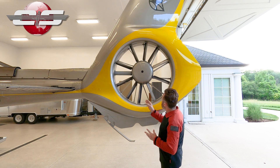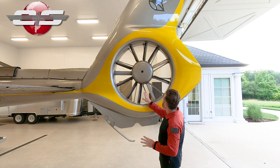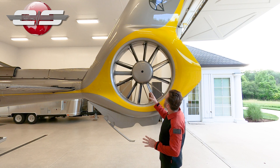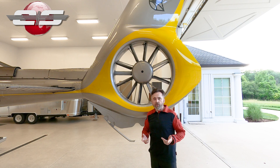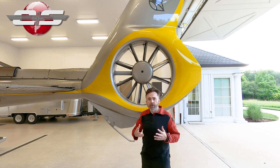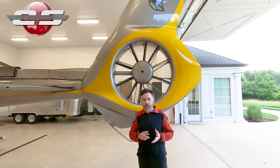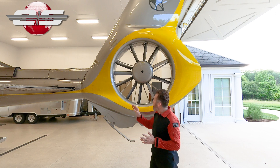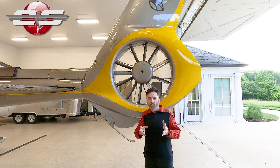So when the pitch is changed via the tail rotor pedals, you'll see that all the blades move simultaneously, and you can see that they're staggered for noise reduction. If you have ever heard an old Dolphin, all the blades were equally spaced, whereas now on the new fenestrons they're unequally spaced to get rid of that noise.